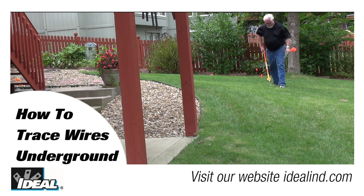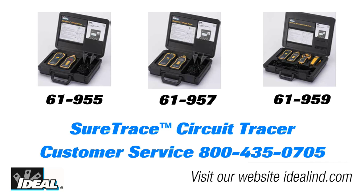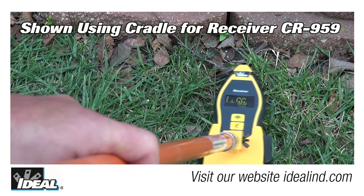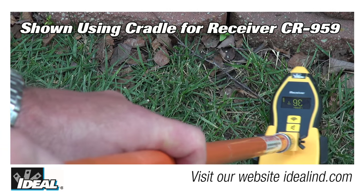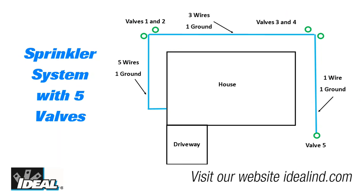In this video, I will specifically show you how to find a cable in ground using a SureTrace circuit tracer from Ideal. These circuit tracers are not underground cable locators, but in favorable environments, they can be used to trace buried cables, conduits, or metal pipe. In my example, I will use it to trace the wires feeding my control valves in my sprinkler system. The wire feeding those valves is about 12 inches under the soil.